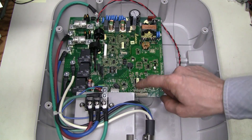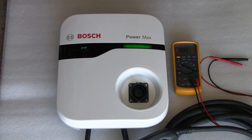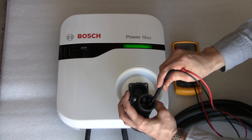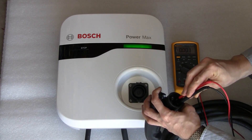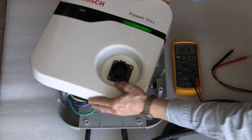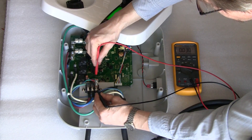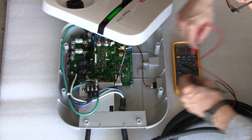So let's connect the front panel back in and give it another try. Now we have the green light, so let's check the pilot. I have this meter set to voltage — here is the ground pin and this must be the pilot pin. We should see 12 volts there, but there is nothing. So let's check inside. Here is the ground and this is our pilot — and there you go, 12 volts. So yes, something must be wrong with the charging cord.